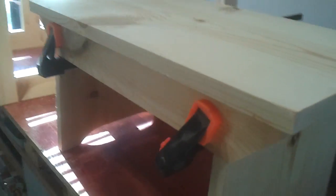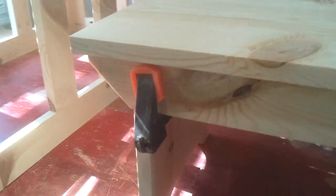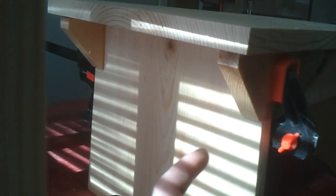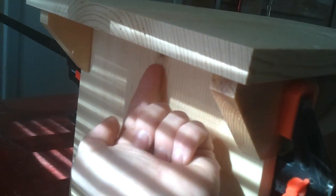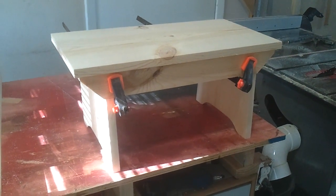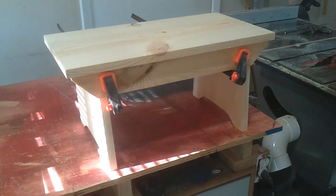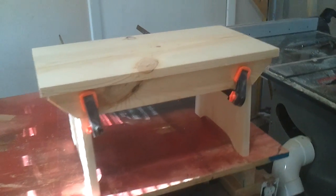I think I'm going to go for a little bit cleaner look. On the inside I'm just going to use a couple of pocket hole screws going into the stretchers, and then maybe three coming up on each leg and a couple coming up on each side. It's starting to take shape. I don't know what profile I want to use on the top yet — it's just going to be a little step stool, so I'm not sure where I'm going from here.